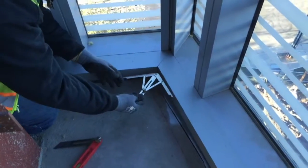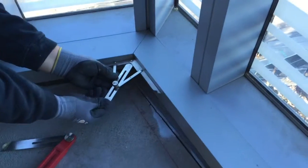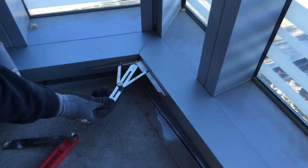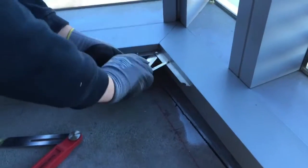Here's our improvement video for the week at ELS. This is how we used to get angles so we could cut our trim — in this case, sheetrock trim — on the chop saw. This is not a 90, so we need to get the angle using an angle divider. Once we get that, it gives us the overall angle.